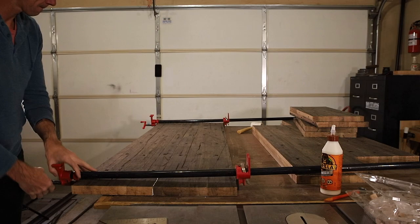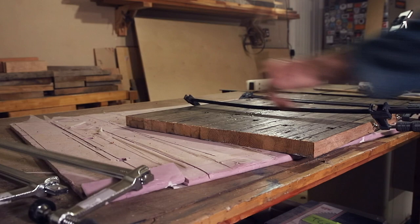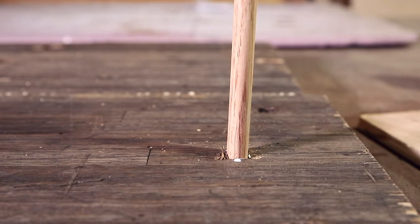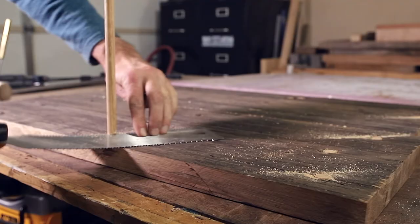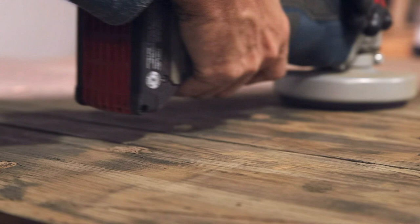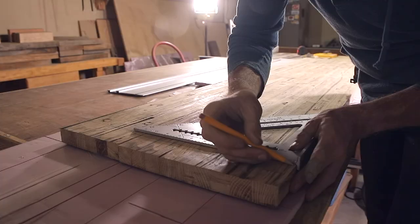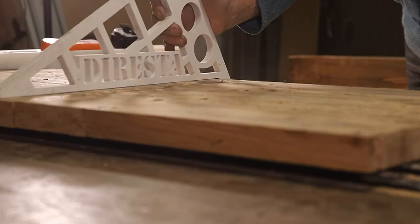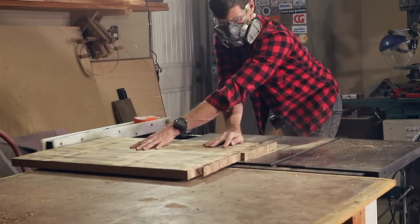Between the tabletop, the shelves, and the center cabinet, there's a lot of wood in this console, so I made all of these panels here, and it still wasn't enough. Once the glue was dry, I could address all the bolt holes from where the planks were attached to the floors of the semi-trailers. I drilled these out with a half-inch bit from my doweling jig, and then filled the holes with oak dowels. I used an angle grinder with a flap disc attached to sand down these panels and remove all the varnish and grime. The longer panel is for the shelf that goes on the top of the console, and here I'm ripping it to width, and then I cut down the ends to length with my track saw. This next panel is for the four shelves, and after cutting them to their final dimensions, I had to go back and cut them in half so that they would fit down into the frame.